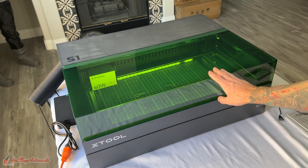This machine has a nice auto-focusing system. When you click on it, you can set the distance and auto-focus measure. If I click on it, you can see that it automatically focuses — it re-probes, comes all the way back to where it was, and now I have a set distance of 43.2. So now I just need to go ahead and click on frame, which frames it up.